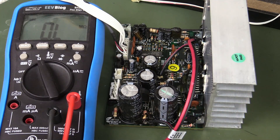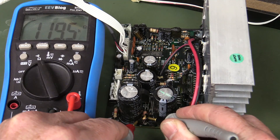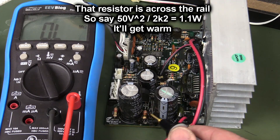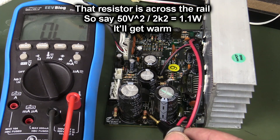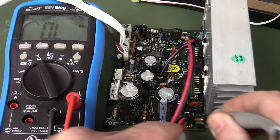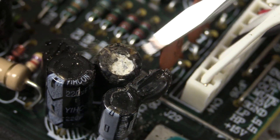This is the board from the other speaker — the one with the oscillation issue — and sure enough there's black gunk, but measuring it it's actually very low: 140k. That's the lowest we've actually seen. Interestingly it's around a power resistor which presumably gets a bit warm, so maybe the localised heat caused that potting compound to go very low resistance. Going elsewhere on the board it's perfectly fine. And it looks like there's quite substantial corrosion on the top of that electrolytic can — terrible.